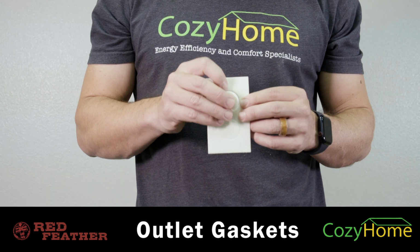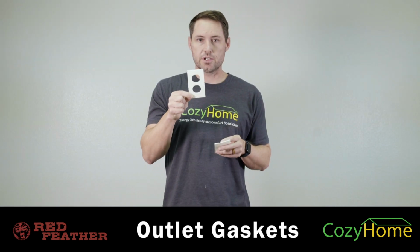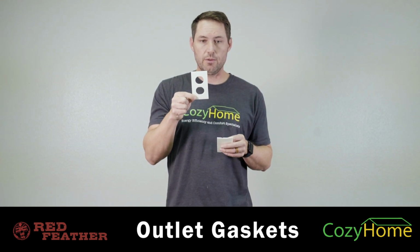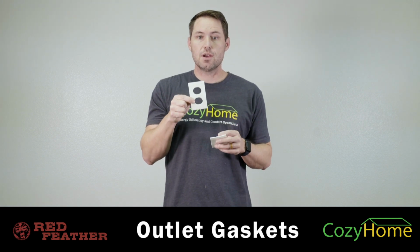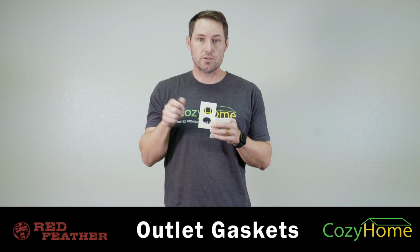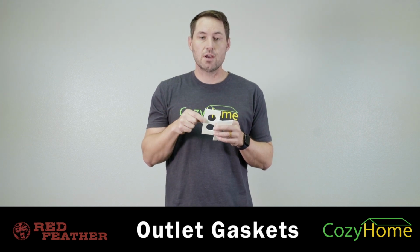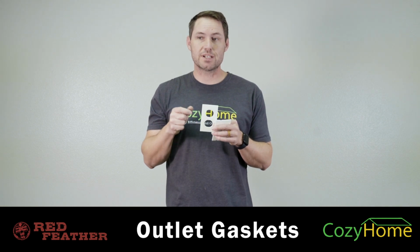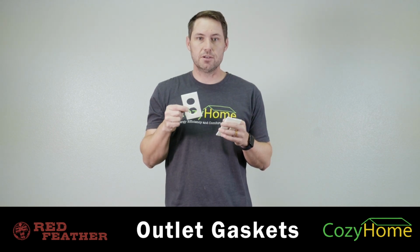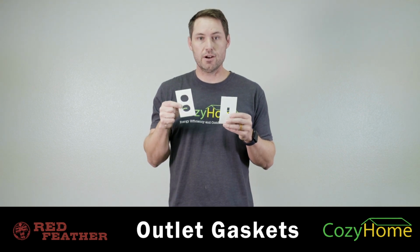They also make them in this style, and I'll punch these out. And this is for just a regular electric outlet on your wall. Same concept, this one has one screw instead of two screws. One thing I do recommend is that you use a hand screwdriver and not a power drill in order to put the cover plates back on, because they're made of plastic and they're usually pretty brittle. So if you over tighten them, they will crack, and then you have to go buy a new one. But these are really easy to install and can really help cut down on air leaks.